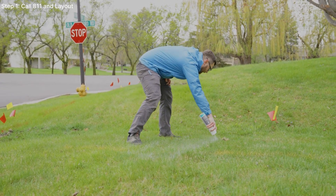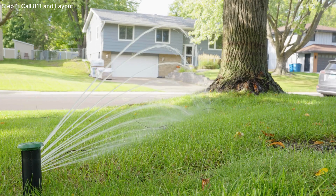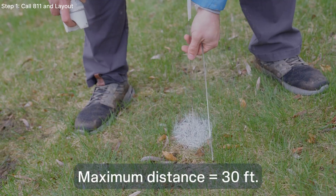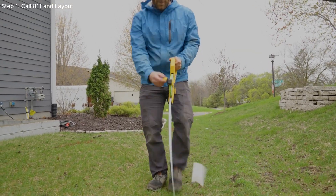Use your design from our website for the basic zone markings. Pay attention to any trees or obstructions in the yard — you'll have to cater your design for those changes. If you meet our requirements, your sprinklers have the potential to reach a maximum distance of 30 feet. The sprinkler cables are 60 feet long, which will get you connected from head to head.